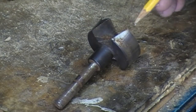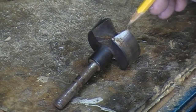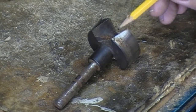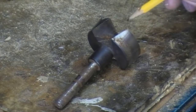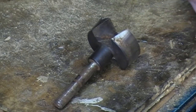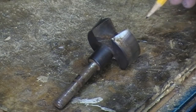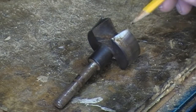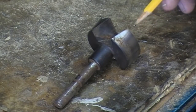If this bit was covered with pitch tar from pine or burn or whatever, I would put on some rubber gloves and some eyewear, get out my spray cleaner for ovens — Easy Off spray cleaner — spray it, brush it a little bit, and wash it off. Then coat it with WD-40, because the cleaner is very corrosive. That's caustic soda — you have to be careful. And when you get done and wash your hands, a little baking soda wouldn't hurt either.